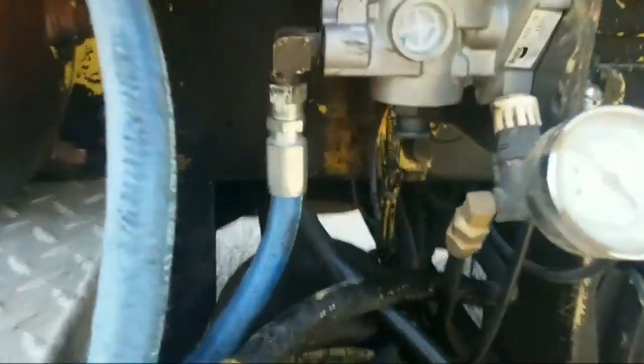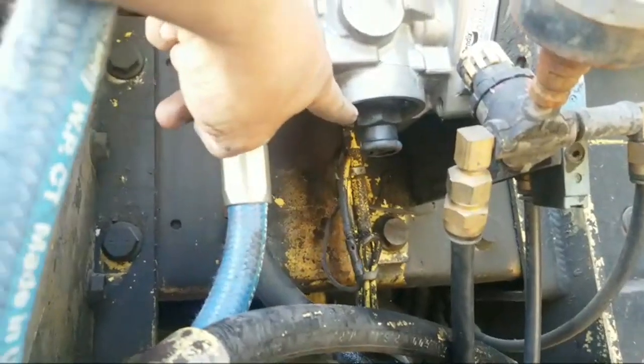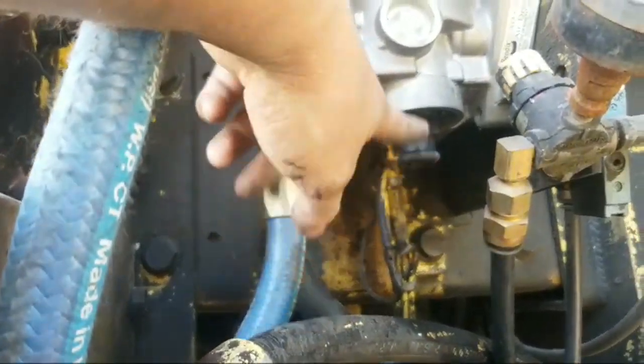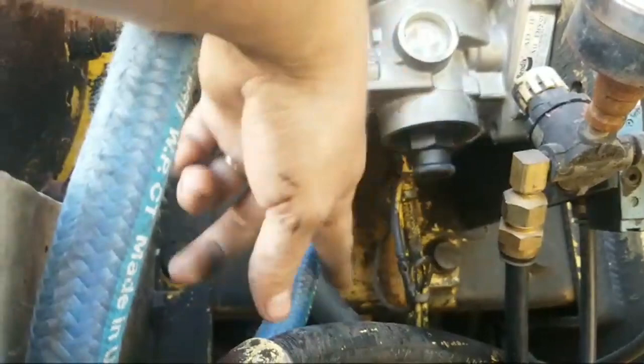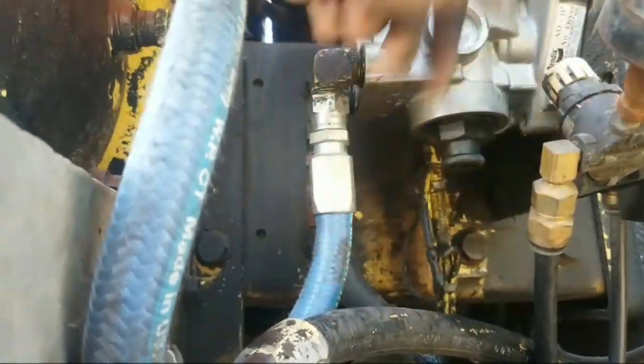The dozer's working good. The excavator's working amazing. I mean, they're both working great. The dump truck. Oh, another thing we fixed, I'll show you. On Monday also, the air dryer went to hell on us. It had been leaking and leaking from this valve right here out the bottom of this. So this is an air dryer, right? And once you get up to like 120 psi, every once in a while it goes psst, it's supposed to. Well, it was just going psst and leaking and leaking.